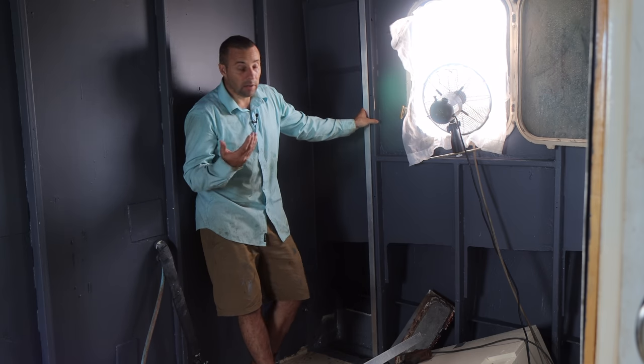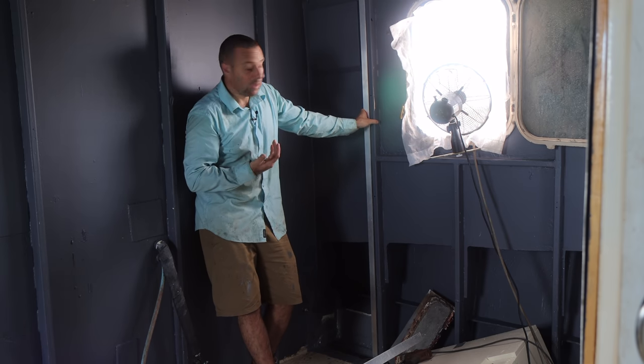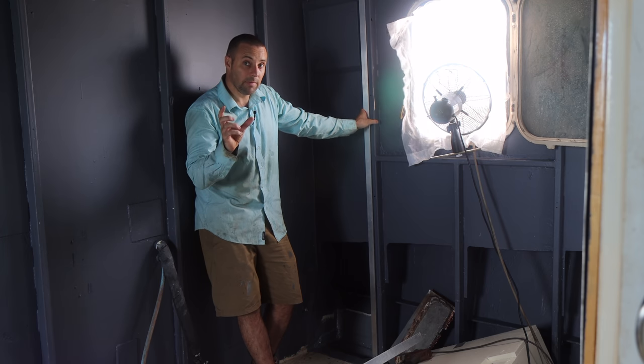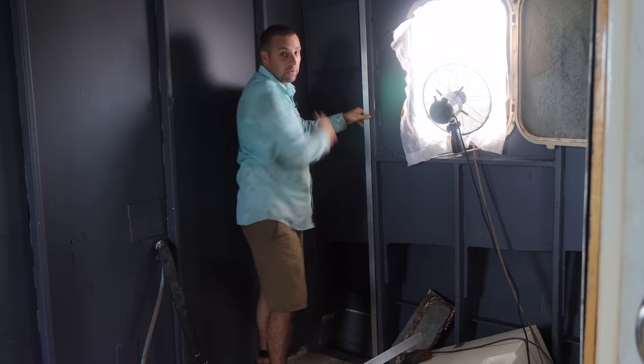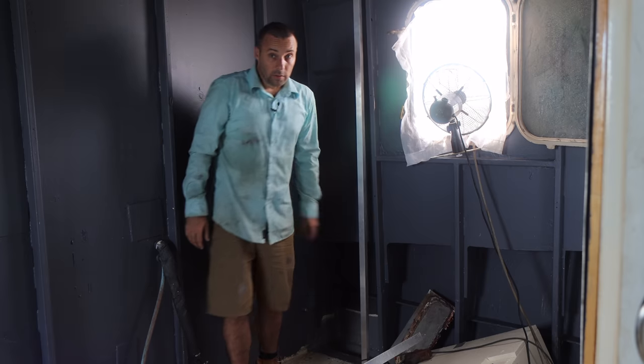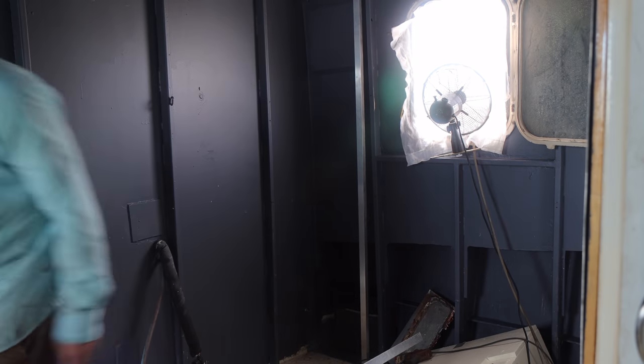So we've got to figure out exactly where these have to go. We have to calculate our insulation size. So we've got 120 millimeters of insulation to take into account, but half of that, 60 mil, is what this has to allow for. So we'll have one layer of insulation over top of this. So a bit of measurements and then we'll glue it in.